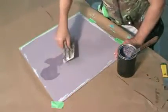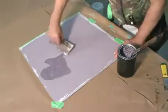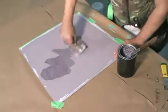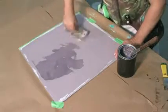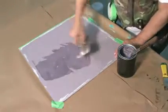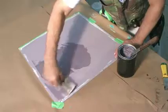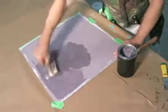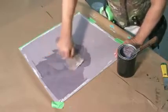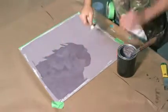Here we have selected to demonstrate a cross-hatch pattern. Begin by applying Venetian plaster to the surface and then immediately following through with a tight stroke, effectively removing and spreading the excess material. This cross-hatch process continues across the entire surface until all areas have been covered. A third and final coat should be applied.